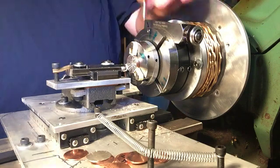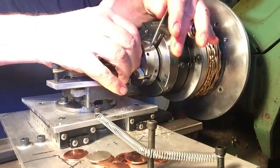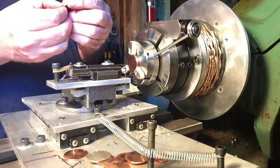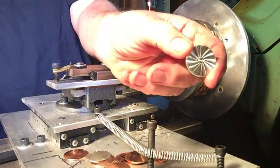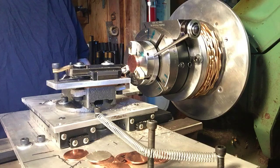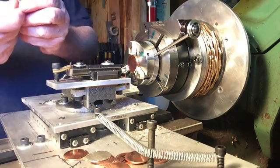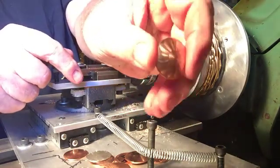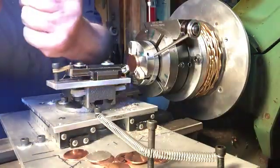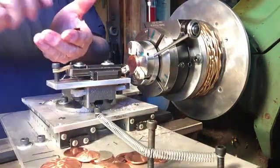So let's see what we created here. I'll use the proper tool — I lost my other one, so I'm using a drill bit. That's exactly what I want. I'm finding that this work is hard to photograph. I'll show you a few of the practice pieces that I've done in the last few days. One of the things that's nice about this type of engraving is what's called chatoyancy — the optical effects of these lines. These have already been domed. Here's a practice piece made out of a 35-millimeter disc using a similar pattern, trying out different rosettes to see what I like.